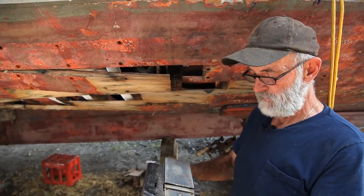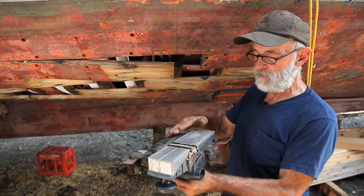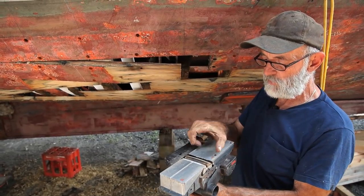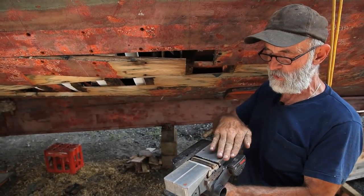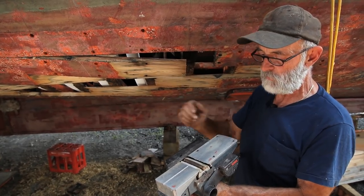What we've got here now is a Bosch planer, and I've rounded the bottom of it so the blades are curved. When planing wet material, a straight blade all the way across would just keep jamming up and I'd have to keep cleaning it out. So I've made a scrub plane out of it — I'm going to scrub this down a little bit more and then shift over to a different plane.